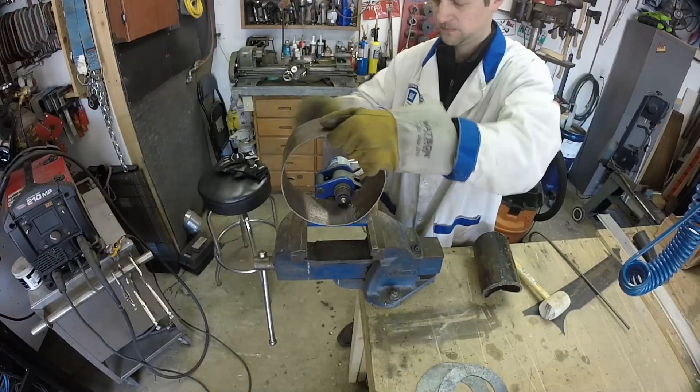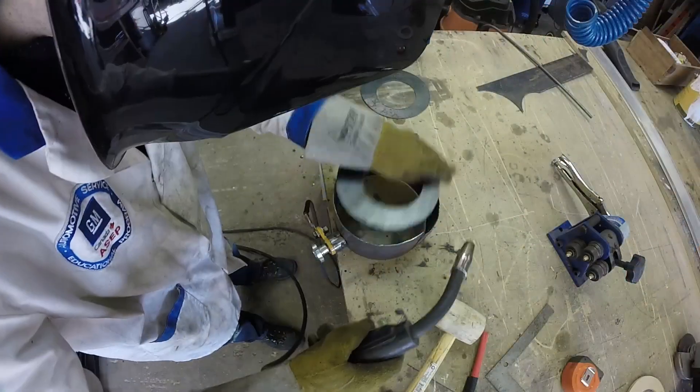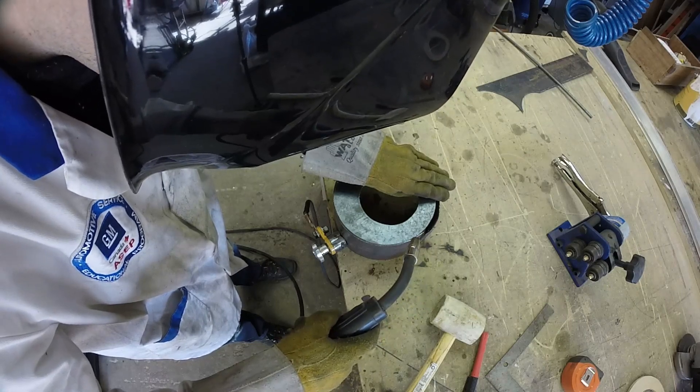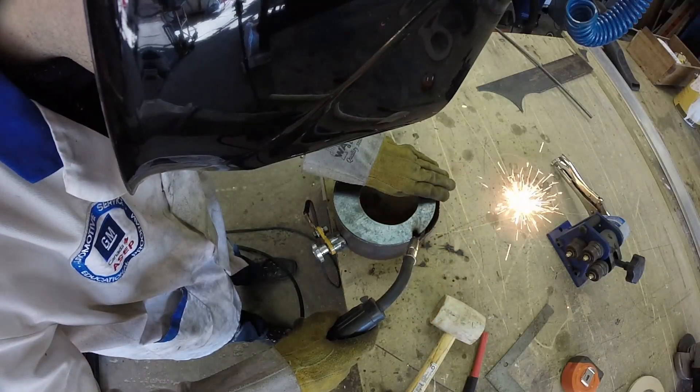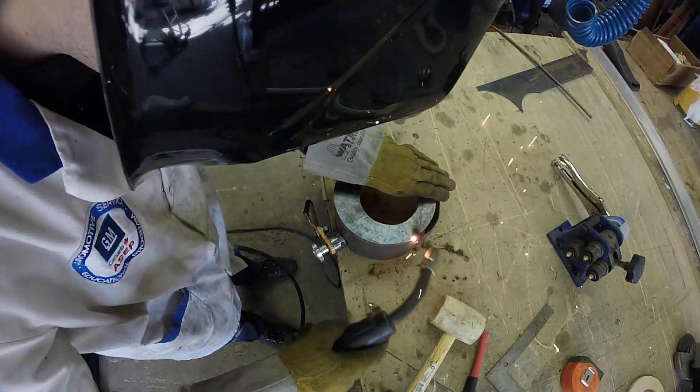The little bird feeder on top is just made out of some thin plate which I plasma cut out with wooden templates, and then I used my ring roller and just by hand to roll the tubular pieces, and then just welded them in and ground them.